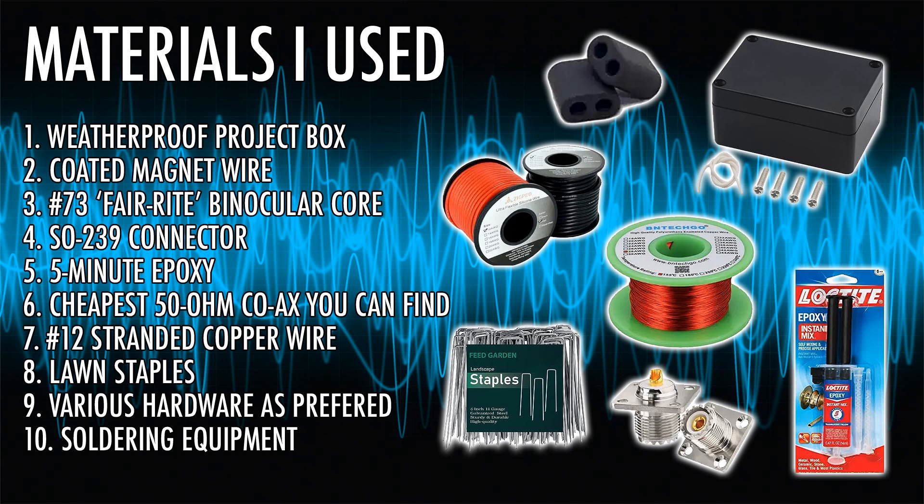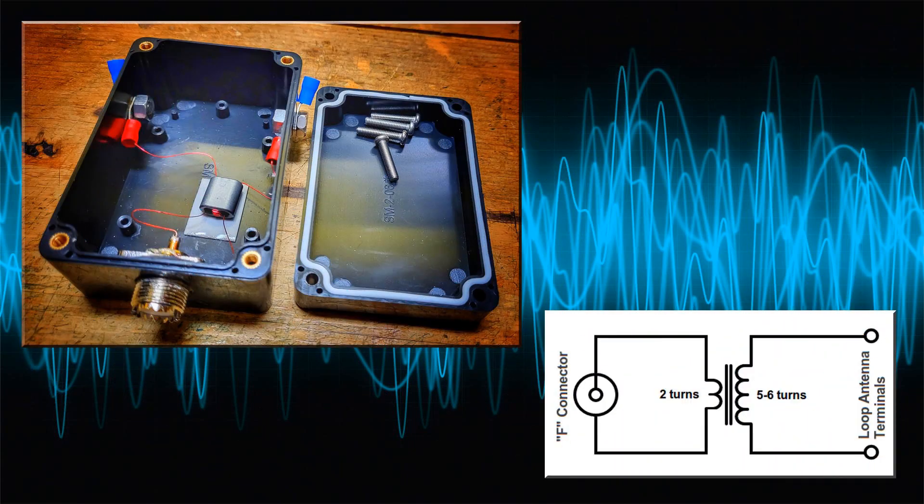If your ground connectivity is poor you could raise it a foot or two, and these would still work much like a beverage antenna a few feet off the ground. It still becomes vertically polarized, and that's one of the main things about having it near the ground — converting a horizontal antenna to vertical polarization gives it its directivity and pulls the noise floor down. Along those lines, you should turn off any receive preamps you're using, because that brings the noise floor back up.